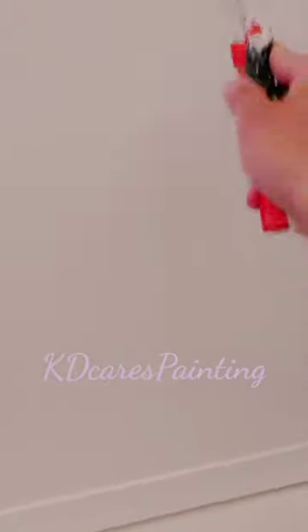What I didn't mention is, every single step, I'm going through with a flashlight. I'm checking every surface to make sure there's no contamination that needs to be sanded or scraped off. Even before and after I roll a surface, I break the flashlight out and make sure that it's smooth. It's all about the finish.